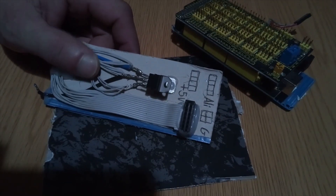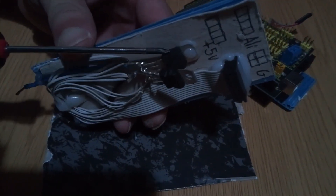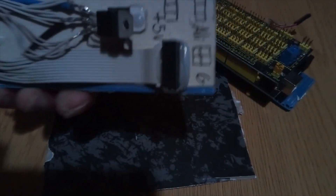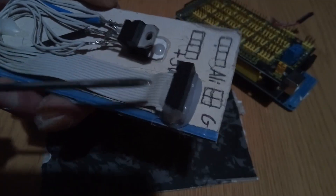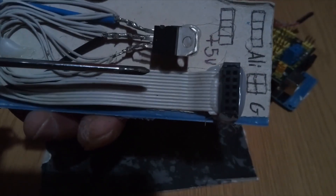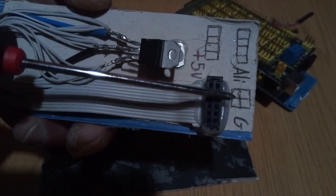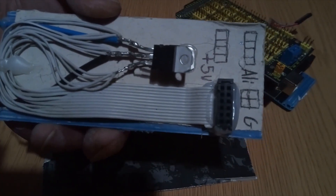To power my system I'm going to use my homemade voltage regulator, which is two 5-volt voltage regulators soldered in parallel to a bunch of wires. This was a computer connector, and all these wires lead to one of these connectors. The first four connections go directly to the positive power source, the next four exit from the five-volt output of the voltage regulators, and the last four connectors are for ground.